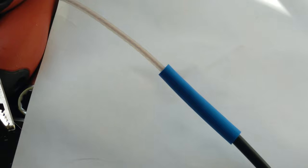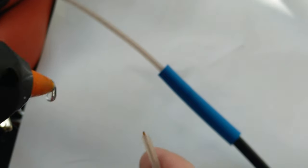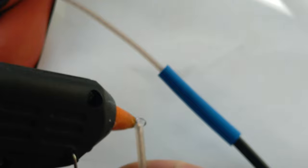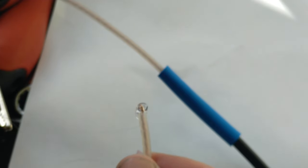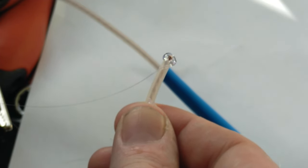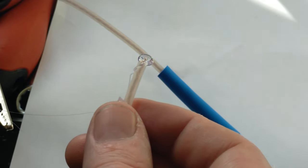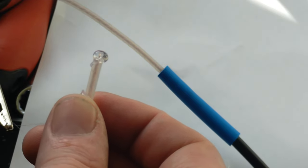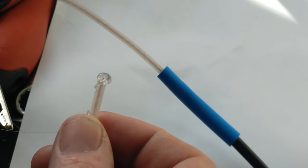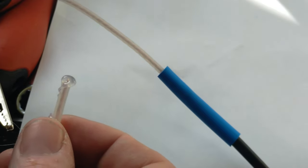I'm zoomed in a little bit to show you the end, which is also in need of some glue. I'm going to try and do that on camera — a little dab just coming out there. I'm going to put a bit of heat shrink across that, shrink it down, the glue should wick in and keep the water out. If I'm going to be using this outdoors and it's going to rain, I don't want water getting into it. I'll pause the video while I heat shrink this all down.